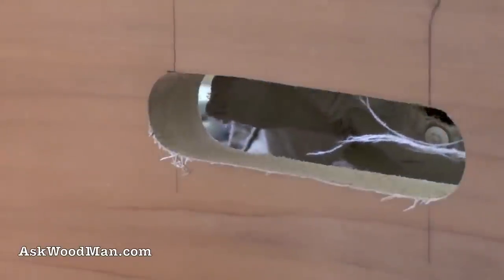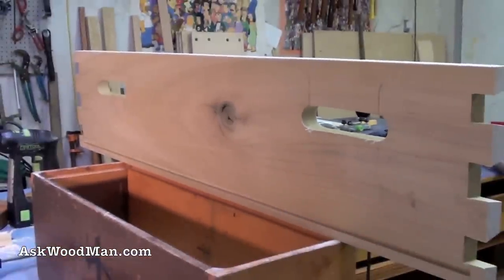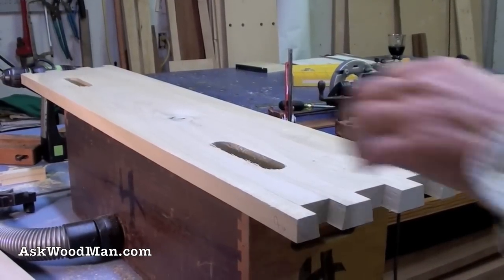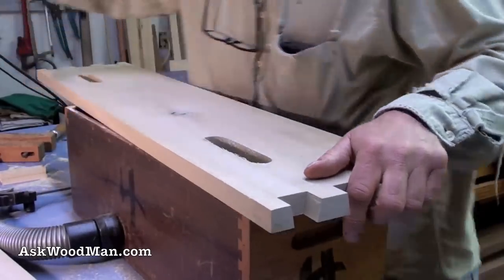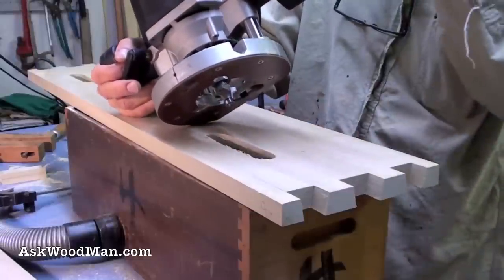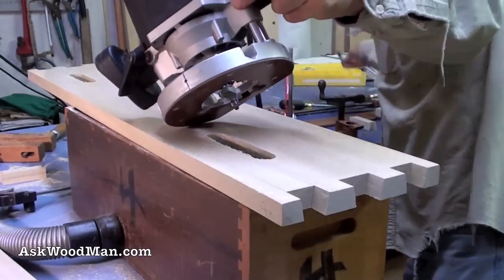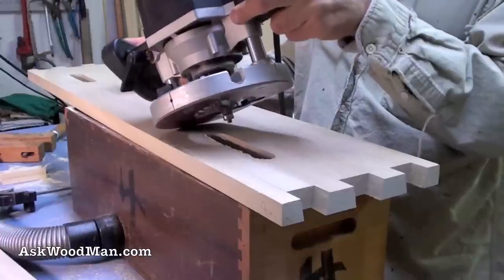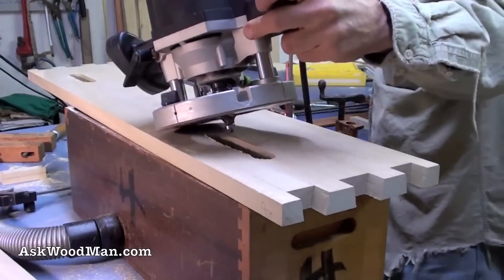My convention is always to do the outside first. I have my tool trigger and my router set up on top of this vacuum box — just a simple box with a hole cut in it. I have a one-inch radius bit, which is really the inappropriate size here. A half-inch radius would be right, but I only had a three-eighths which wasn't big enough. This material is about seven-eighths thick and I didn't have an intermediate size, so I'm just going to make this work for these drawers.